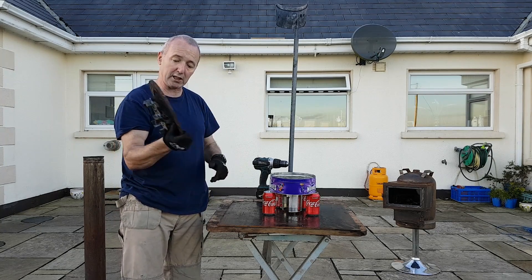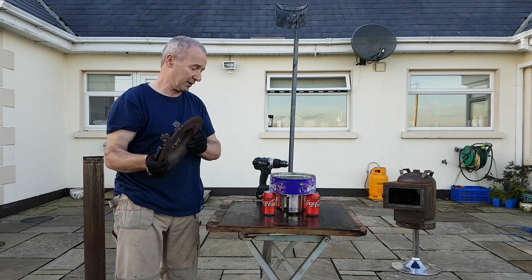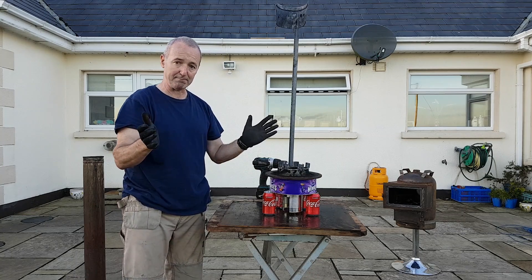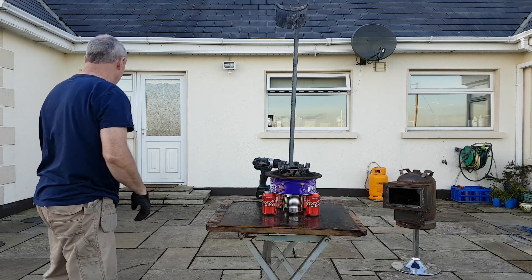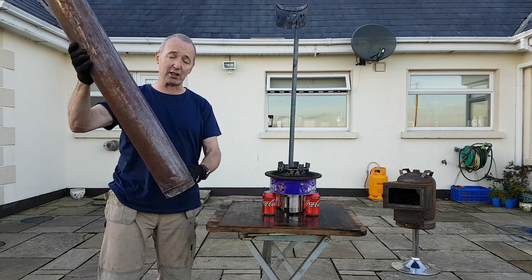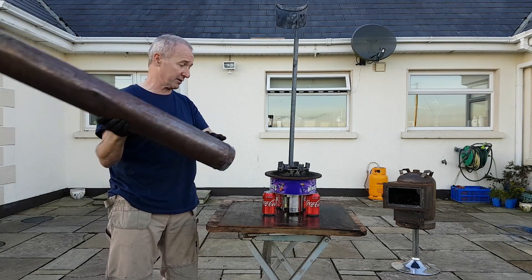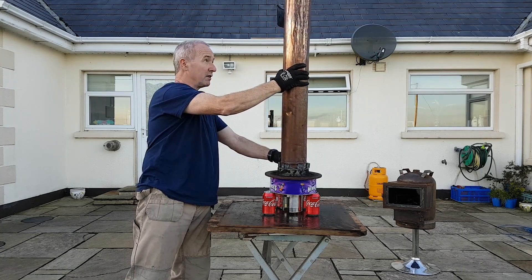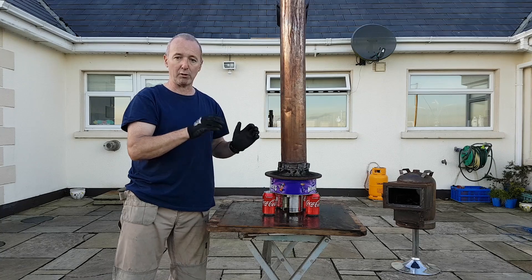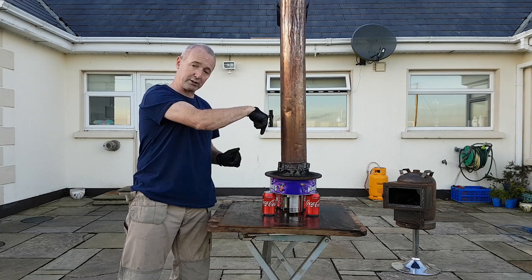This is just the center of the flue — it also gives me more room underneath for a combustion chamber. I'm trying to replicate the stove. Now this is one meter of five-inch stainless steel lightweight flue. You can get this stuff anywhere — you could use pipe, anything you want. The idea is it's going to sit in here and it's not going to blow over. When I ignite this, that's how it's going to be set up. For now I'm going to take this off and light it through the opening.